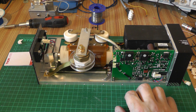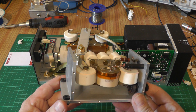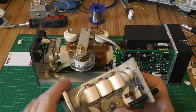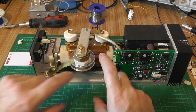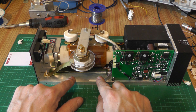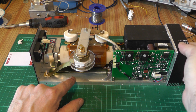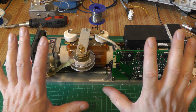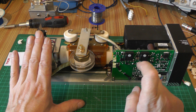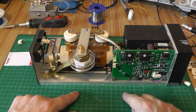Obviously we can do better than this — it's horrible, radiating RF everywhere. It would be really nice to get the metal case back on it. In a previous episode I tore down a very small LSI nitrogen laser and we've got a triggered spark gap in there. My thinking is we'll get that triggered spark gap out, mount it somewhere in this case, build a little trigger circuit, and there should be enough room in the back of the case for a small trigger PCB with a trigger transformer and a high voltage power supply with additional control electronics. My suspicion is it's going to be fantastic. Make sure you hit like and subscribe and wait for me in the next episode, folks, where I do exactly that. Thanks for watching Leslie's Lab — if you want to see more content like this, don't forget to hit like and subscribe below, and I'll see you guys next time.